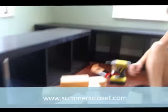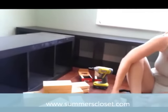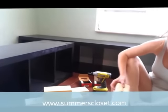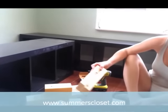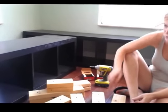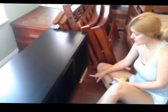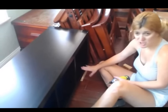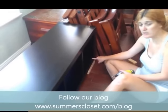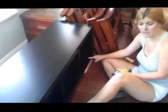We're taking some long 2.5-inch drywall screws and drilling a couple of them into each one to connect them, so we have our 3-inch height that we need for the shelves. These are going to go underneath and then be drilled in from the shelf to attach them. The legs on these Expedit shelves from Ikea have pre-drilled holes on one side — we have two holes pre-drilled here, and we are using them.